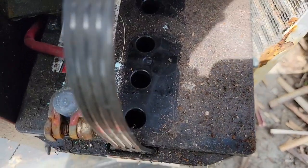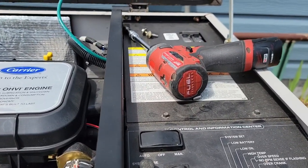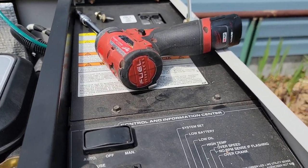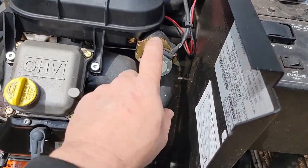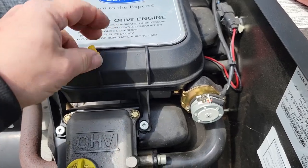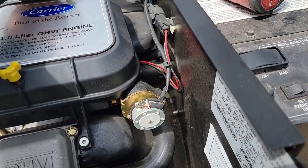Checking our water level - water levels are important, especially on some of these generators. This one has a crappy battery charger on it. These old ones were a bad design - everything about them was bad. They had an independent battery charger, independent voltage regulator. It was their starter series. In 2005-2006, maybe 2009-ish, this design was pretty popular. This one has the servo on it and might even have a choke. They started out very primitive - no choke, no servo, all spring-controlled - and they didn't start for crap in the wintertime. It got a little better when they added some of these other things.